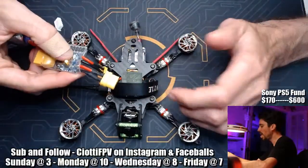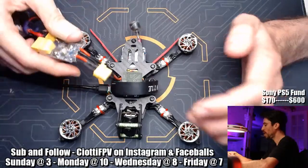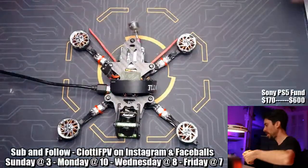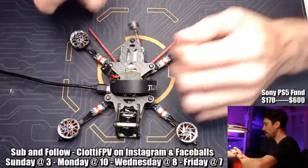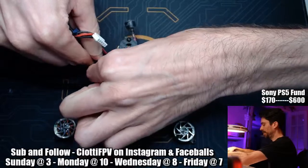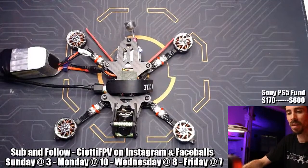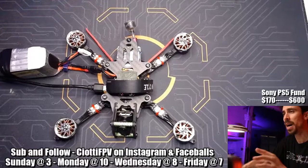So we got it. Power button on. Hopefully no fireball. No fireball, but it did trip the smoke stopper. It was to a point where it had given me all the beeps. So now we're gonna plug in full voltage. Hopefully it doesn't catch on fire. Good to go. So now we're going to spin these motors up. The amount that you spin the motors up is dependent upon your motor idle. I've been using 5.5 motor idle percent. It's not too low, it's not too high.